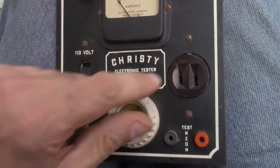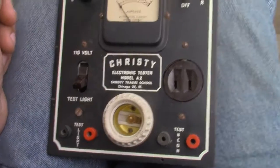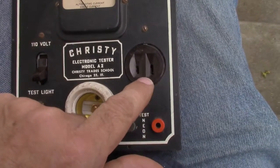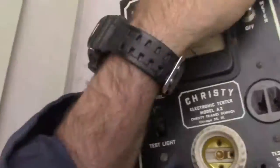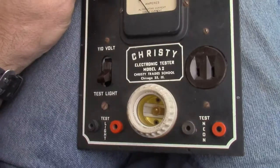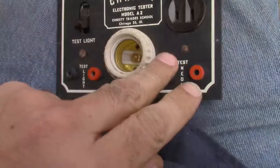It's entirely possible they never re-screened these and just kept making them. They couldn't be bothered to get the labeling on there just right. There's no ground lug, and the plug is not polarized - well, take that back, that one is polarized, but it might be installed wrong. There's no line cord on this, so back then it probably would have come with an unpolarized mains cord.